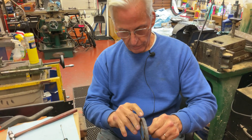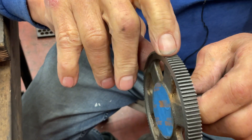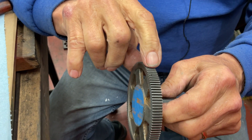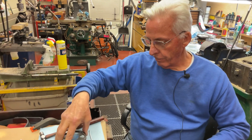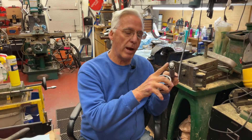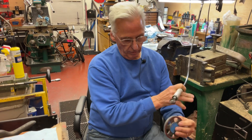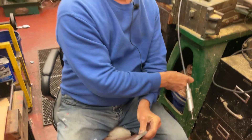On the gear, you see this hole right here? There was a bubble in the casting and it broke out. It hasn't broken the tooth and the tooth is still in really good condition. If you look closely, you can see the roughness on the top of the gears from machining — it shouldn't be there, but it'll be fine. If you get overspray in the gear teeth, I'm going to come in with a brass wire brush instead of a steel one. The brass is softer than the cast iron and it'll just take all the paint off — zoop — and you'll be done. It'll look just fine, and I'll show you in the next video what this looks like when it's done.